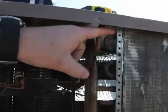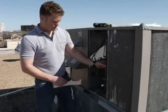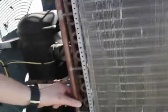This is the top tube — you want to start with this and move down. Also at this time, you would want to get the tube diameter, which means the diameter of the tubes going in and out of the coil. This, for instance, is a three-eighths. Most condensing units are three-eighths inch tubing.